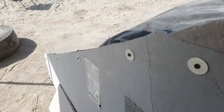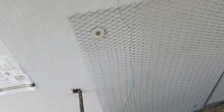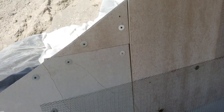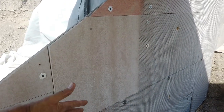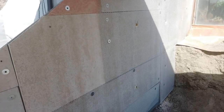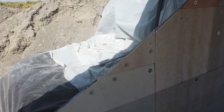Then we'll take some large washers, put them over the rebar, weld the washer on, and cut it off real close. With a couple layers of cement plaster on there, it won't even be noticeable — it'll be well hidden. But that'll give it some strength so if dirt falls back here it won't push the wall out and crack the plaster. As far as working with tire bales, you can put screws in and they'll hold pretty well, and rebar holds really, really well.